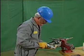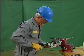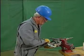In this example, the mechanic places the lead screw into an alignment hole in the shaft. Then he tightens the lead screw. He checks the position of the jaws to make sure that they will only push against the inner ring.